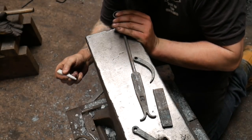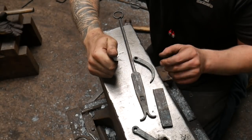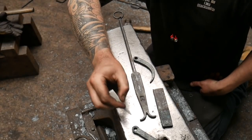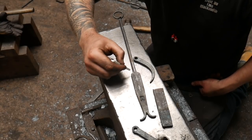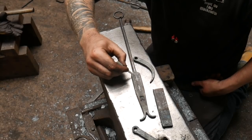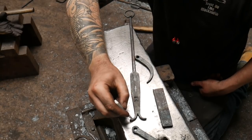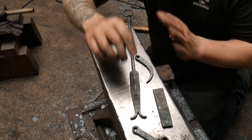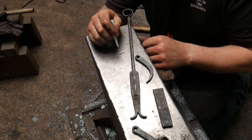They're not in line — so what I'm going to do is center dot those now and then punch them through again like we did before, obviously keeping the other end cold. If you're unhappy with this area, just run a grind around there to tidy it up. I'll be bolting this together, with probably one arm underneath and one on top.